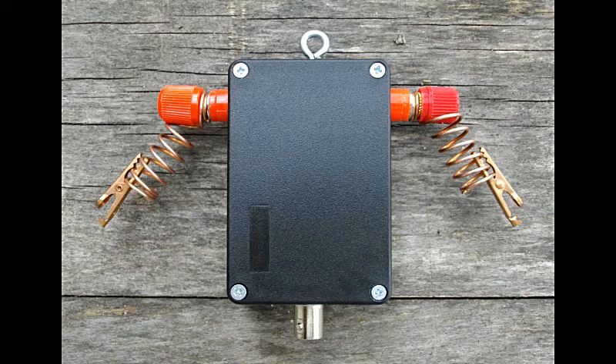As you can see, I've changed the way that you connect the wires to the binding post. Before, I had some terminal lugs that were soldered to the end of the 22 gauge wire, and I didn't really like that. It posed a problem — there was a 90-degree angle from where that connector came out, the wire turned, and I felt there was going to be stress on that wire.